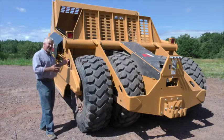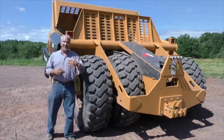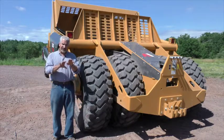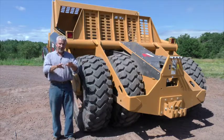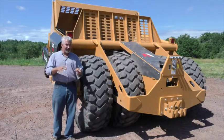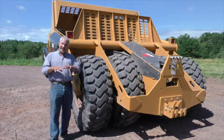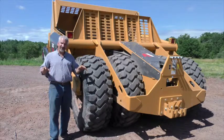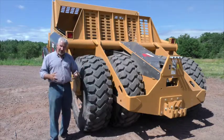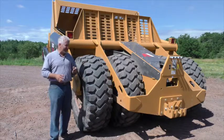We wanted to give the best of both worlds. You can mount the tires in line as shown here, or move the outside tires forward eight inches for a better offset — more than John Deere offers. You can also move the outside tires back and keep the front ones in place, so you can offset either direction. John Deere sets the inner tires back and outer tires forward, but we give you the ability to move both tires forward, both back, or any combination. When in line, it does a better job of compacting — a big rolling pin effect — while offsetting one tire lets material get around one tire before the other makes contact. We're the only one in the market doing that.